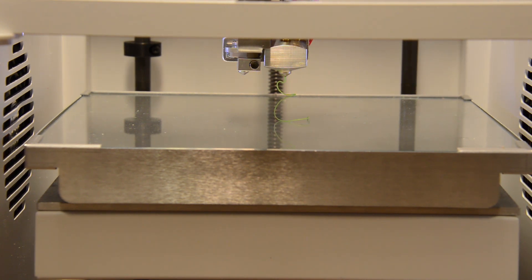Also, look for the first colour layer you've added to your model. In this case on the Make Robot we've added yellow as the first colour, so push a little bit more yellow through than everything else — so your starting layer begins at the colour you set in the software. Once you've done that, you can commence the printing by pressing the print button.